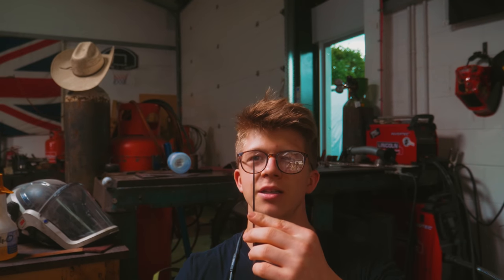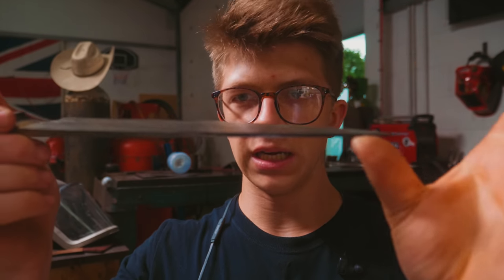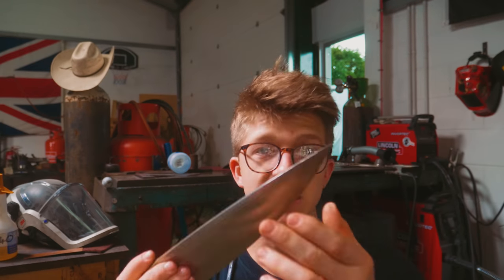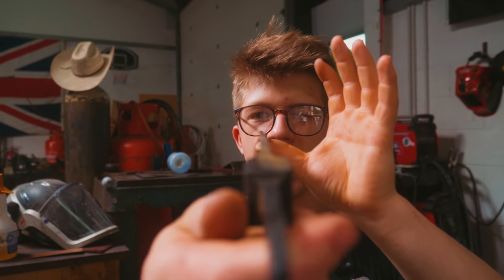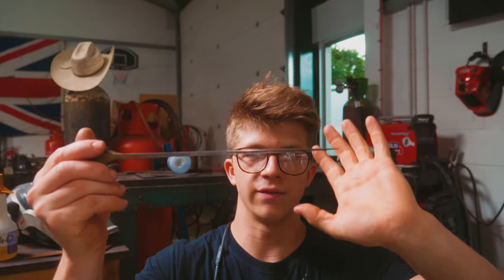I have no idea if I can show you this — it's extremely slight — but once you notice it, you can't not notice it, and it is certainly not acceptable. Fortunately, we've still got a good degree of thickness in our edge, so I need to take a very minimal amount of material off one side and take all the material off the other. My spine itself also follows that slight upward curve. The whole mission here is to make a really fabulous knife — so much better than the chef's knife I made last year — but the trouble is, it was a year ago. I can't accurately remember the problems I encountered, the mistakes I made, and how those mistakes came to be. Am I making the same mistake? That's what's going through my head. So I'm just trying to be cognizant at every step about what I'm doing, not skipping steps, and trying my darndest to do a hell of a lot better than I did last year.